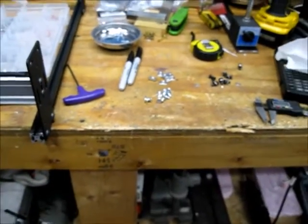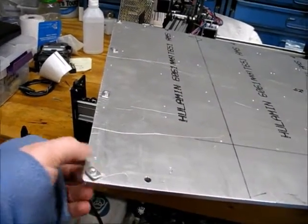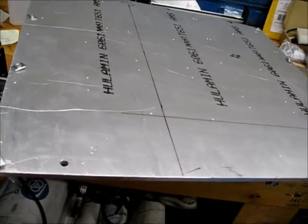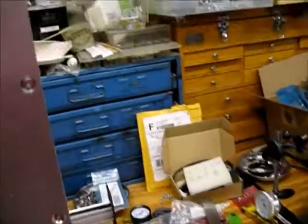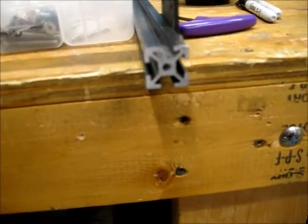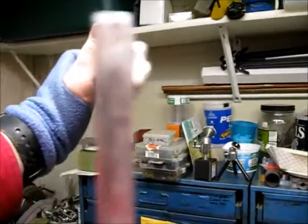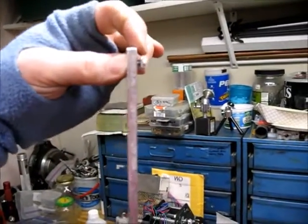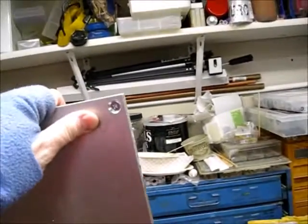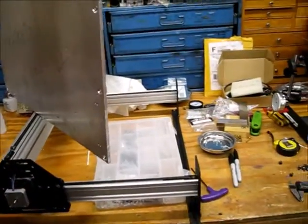I'm going to sit up at the drill press and drill and countersink those holes. I got my plate drilled and countersunk and put all the bolts and T-nuts on the back side. On the front side, slight change of plans — I did countersink them but forgot to account for the two millimeter thickness of the webbing. So the seven millimeters was from the top of the flat head screw to the top of the T-nut. To fix that I just counterbored the screws down two millimeters and all is good. Next I'm going to pull those bottom rails out, get them mounted to the plate, and see if I can get this whole thing put back together and square.